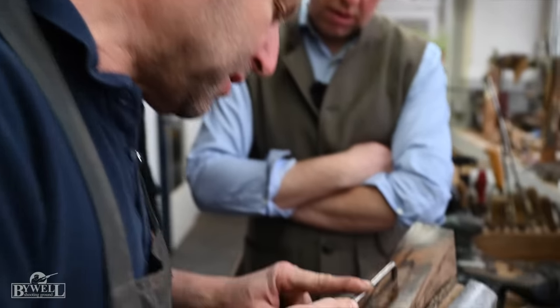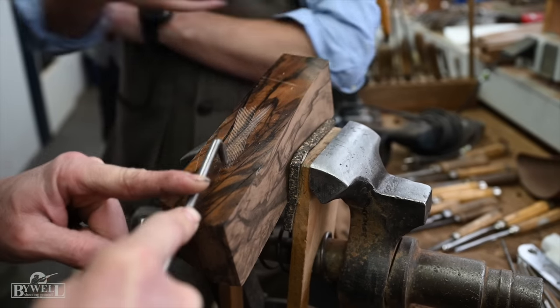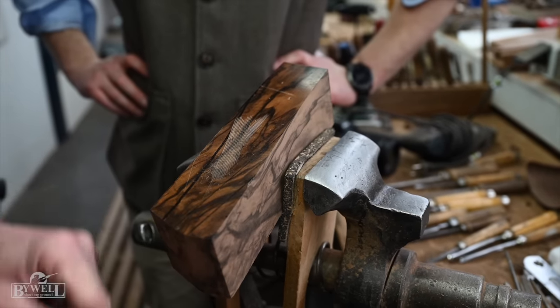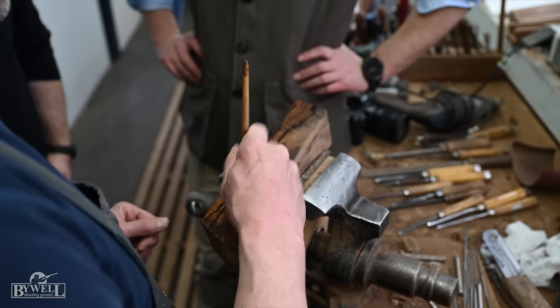But look, the thing is, you have to recut the other side also to get the pyramids straight. You had these little spots in, so we recut it one or two times over cross. So how did you work the angle out? That's by eye. Yeah, millions of years of practice. The thing is, if you go too flat, it's more a square, and if you go too extreme, it's not a nice diamond. It's very long, very thin, and the risk of breaking it out when you handle it is high. Look, now that's perfect.